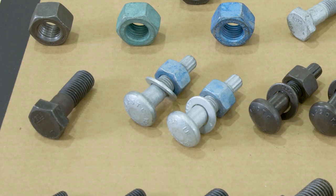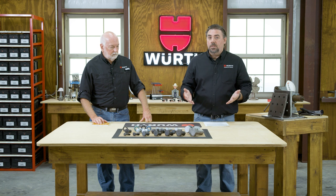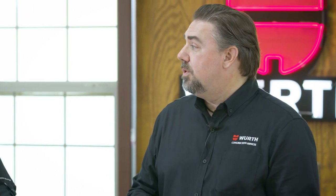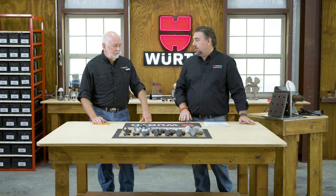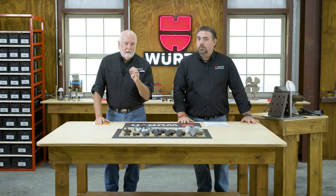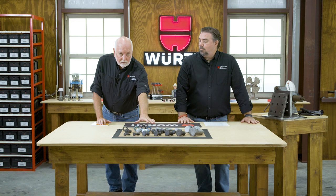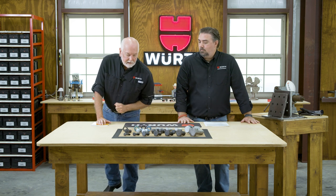These other ones with rounded heads are referred to as tension control bolts — TC bolts. In the 120 KSI group, those are also your F1852s. They are an assembly that comes direct from the manufacturer — it includes the bolt, the nut, and the washer. That assembly is a package, so when you get to site you can't mix those components with others. They have special tooling to assemble these TC bolts. We're going to do a separate episode just on TC bolts.